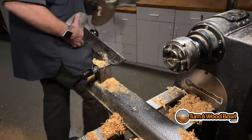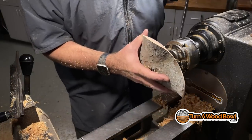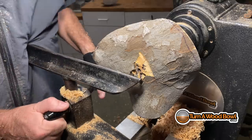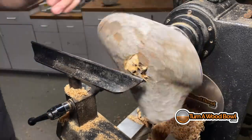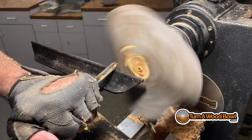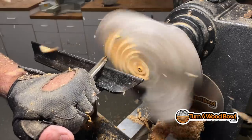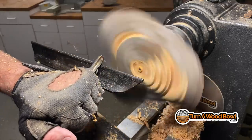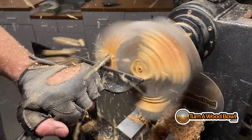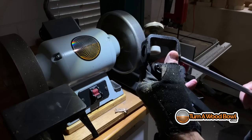With the four-jaw chuck installed, I'm going to mount one bowl and start removing the interior. This is an important step: make sure you turn the piece by hand first to make sure there's no contact with the tool rest. Because you've got these extending wings that are pretty delicate, you can really tear them up quickly if they smack the tool rest. Get in the habit of spinning the bowl blank and making sure it clears everything before you start the lathe. I'm removing a little bit of material in the middle just to balance it out so it's turning well, then I can get the lathe speed up a little faster, working the outside edge first — I do not want to remove the interior first.